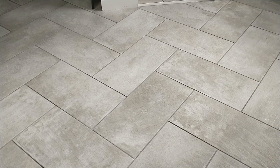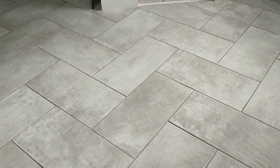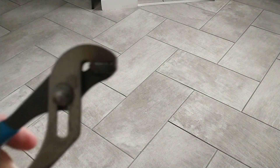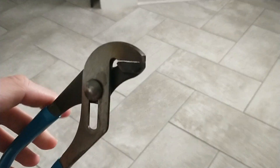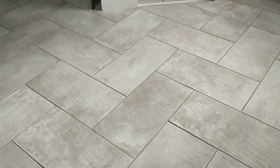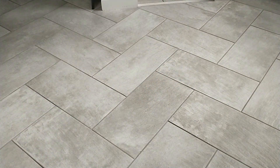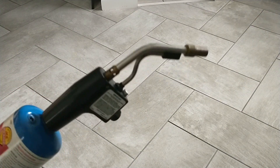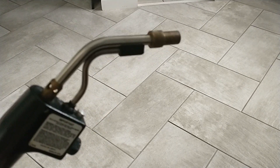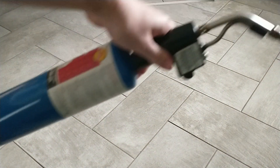You're going to need a few tools to successfully burn your anvil printhead tubes out. First, I've got my clogged tube here. You're going to need a pair of pliers — you can use slip jaw pliers or needle nose. You can see from the burn marks I've already done this with these. You're going to need a spray bottle full of water, and lastly you are going to need a blow torch. You cannot get hot enough with a cigarette lighter or a smaller torch — you need something that looks basically like this.